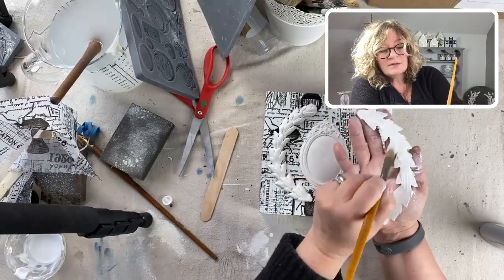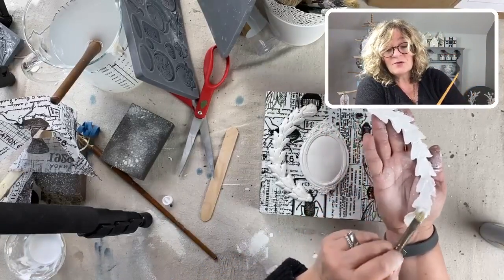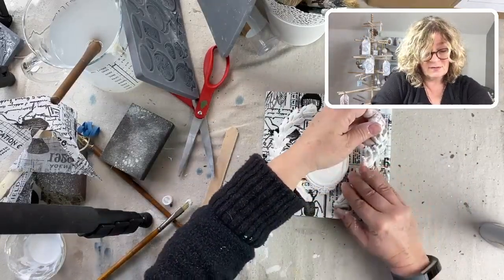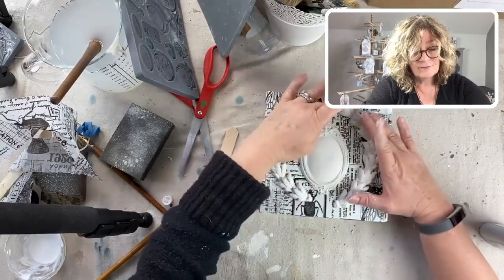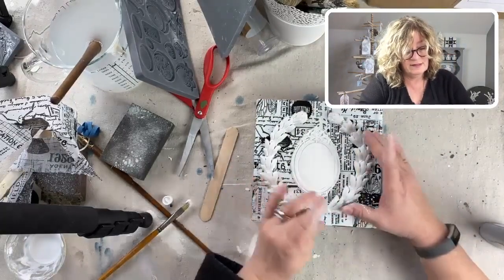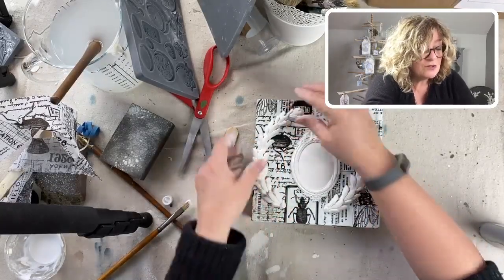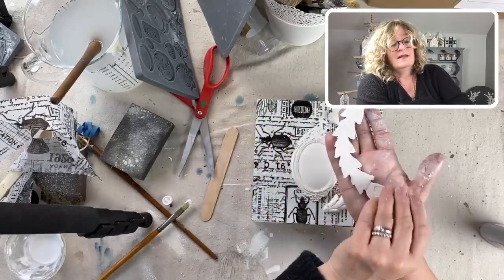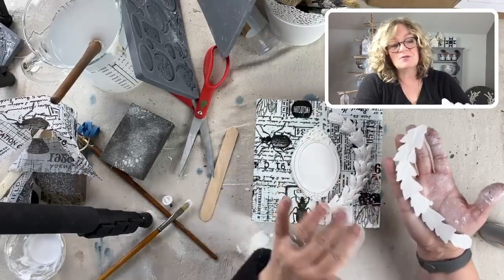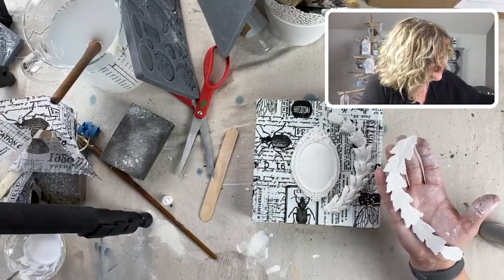Move that glue up. Everything I'm showing you, you can also do on furniture - these look beautiful on furniture. It's already beginning to stick. The reason we glue them on wet is because they shrink a little, and you might think you're putting them on an absolutely flat surface, but you're putting them on an irregular surface so they're not going to lay flat. This is the remedy to that. I'll even paint them wet.